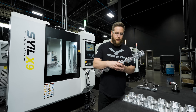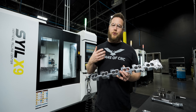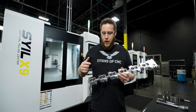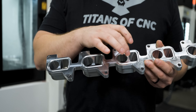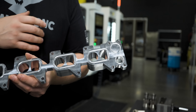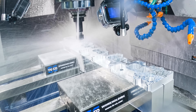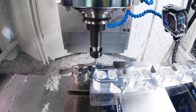Now we're going to come in and start machining the o-ring grooves. I'm going to run coolant on this because I'm full-slotting with a four-flute tool, so sorry if you can't see much. All we're doing is coming in and ramping down on these o-ring grooves, going all the way down around these two holes and then coming back to do a finish pass on the outside OD for a good quality surface. This is an end mill with a 15 thou corner radius, as most o-ring grooves require. Once done with that we'll come in with a chamfer tool to chamfer everything and this part is complete.